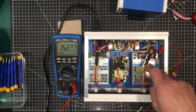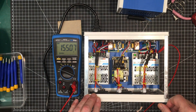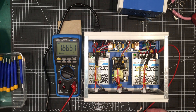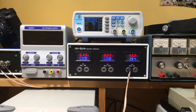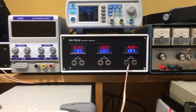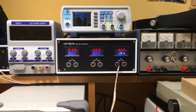I've done tests on these power supplies before and they come out way better than their published specifications, so I don't expect these to be very noisy at all. I've put the additional capacitors on as suggested for quiet environments, and I've put Y capacitors from the negative DC voltage to earth ground to reduce leakage voltage as much as possible. Let's put the top back on and view it in all its glory — there it is in place.